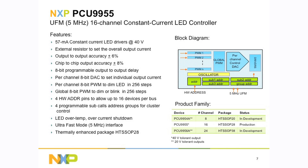And then the PCU9955 — again ultra-fast mode with the U; if it's an A, it would be a fast mode plus one megahertz device. This is a constant current device where you can actually set the current being driven through the pin to have more consistent current through all the LEDs. It has PWMs for each one of the bits, a global PWM — 256 steps, 256 steps, constant current. You can adjust the current through software or with a resistor. Different addresses for the devices. You just put it on the ultra-fast mode bus and you can send data up to 5 megahertz, so you can have more devices on the bus and talk to them much more quickly.